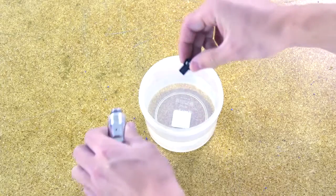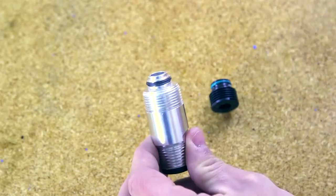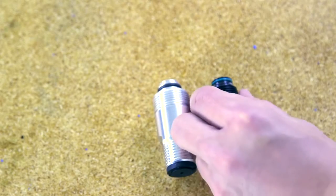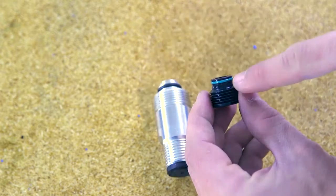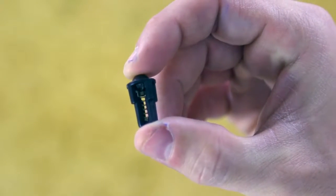Clean the outlet valve assemblies with warm water or appropriate flushing fluid. Make certain the O-rings are in place on the valve plugs and front valve. The check balls should move freely against the spring in the retainer.